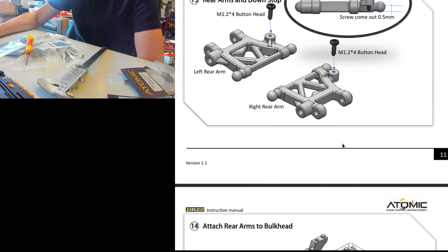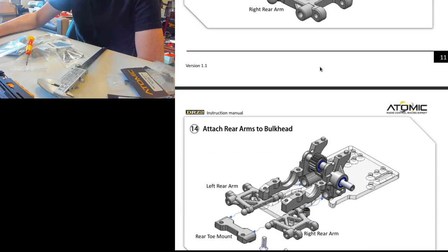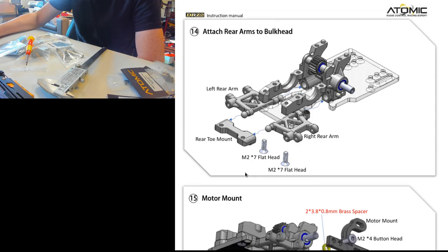But the one thing we will have to do, and this is where that sandpaper comes in handy, is while we're doing this, fit it, check to see if it binds, even the slightest bit of binding, sandpaper it down, put it back. And so it's not that any of these steps is expensive individually, it's that all the minor fiddly calibration work just takes forever. And that's where the distinction between a good build and a great build is how much extra prep work you do.